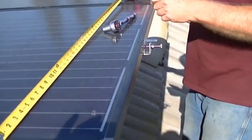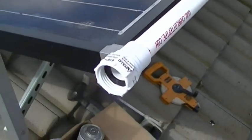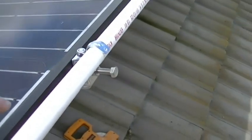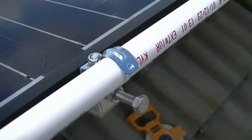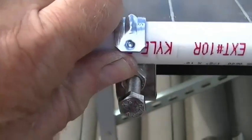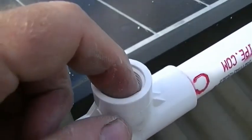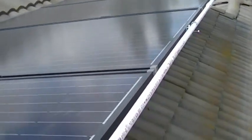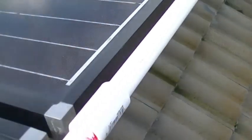That's how you do it. Once all the clamps are on, we went ahead and did the PVC work. This is schedule 40 half-inch PVC. I put a hose fitting on it — that's where we're bringing the water up. Then a one-hole strap bolted here around a half-inch EMT strap that I flared out just a little bit. It really holds nice and tight, very snug. This is our first wash head — it's a T with slip glue joints and a threaded half-inch fitting for the washing heads, one here and one at the other end. All the way down the line, about every 32 inches, we have the clamping system with the EMT strap.